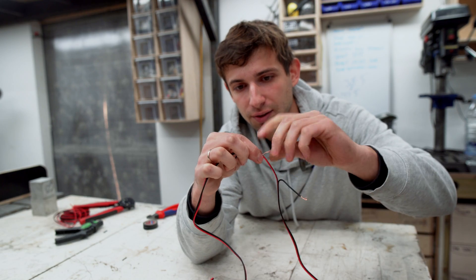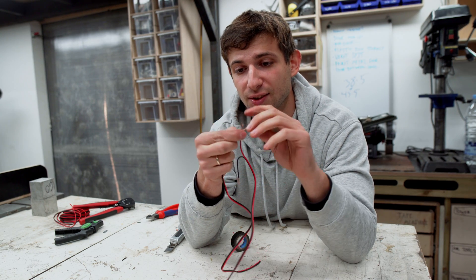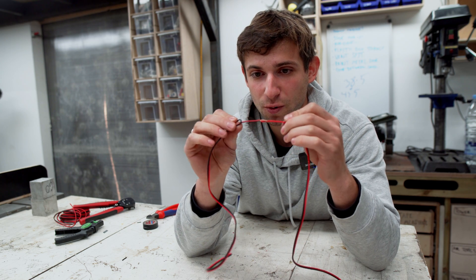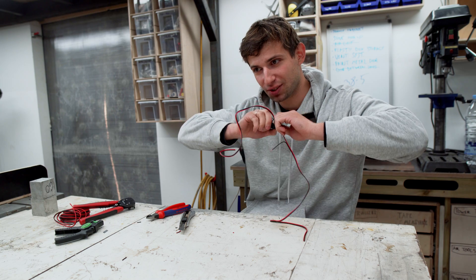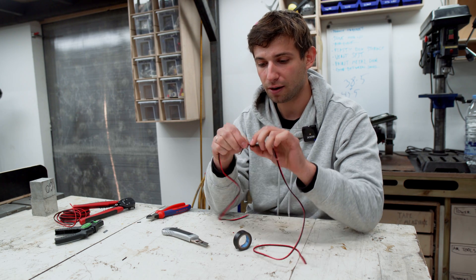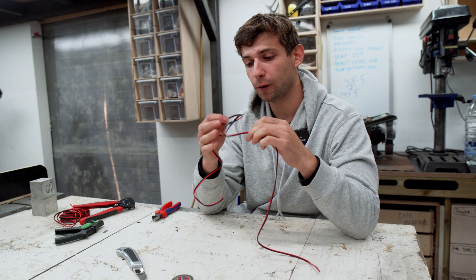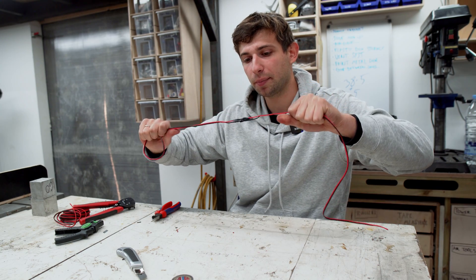I would usually split the core of a cable into two equal parts, connect them, take one end of each pair and twist them together, take the second part and twist, then twist the two together. Or even a simpler way — just take the two ends and twist them together. Then put some electrical tape around it nice and tight. I prefer to use a knife to cut the tape off rather than ripping it, which stretches it. Then fold it down and put some more electrical tape over it so it wouldn't be so easy to rip apart.